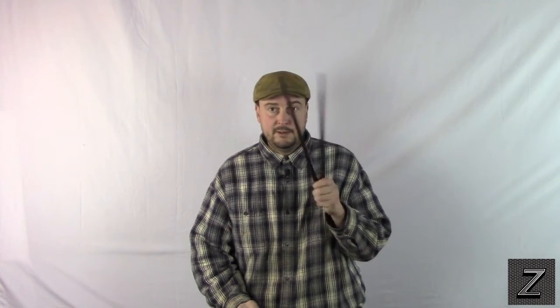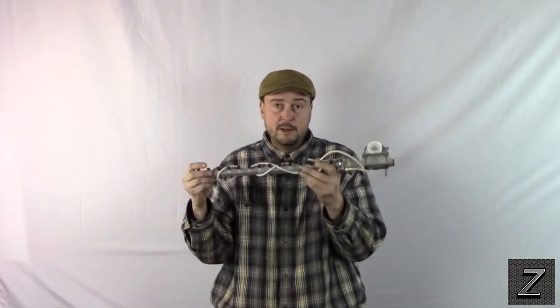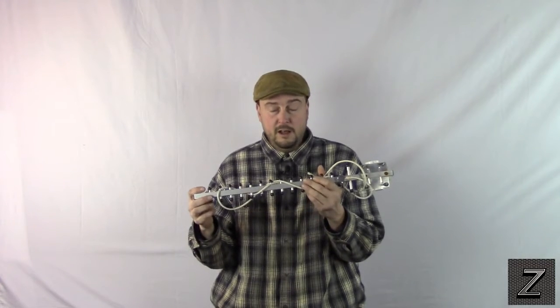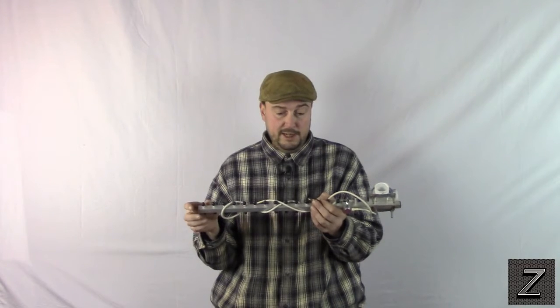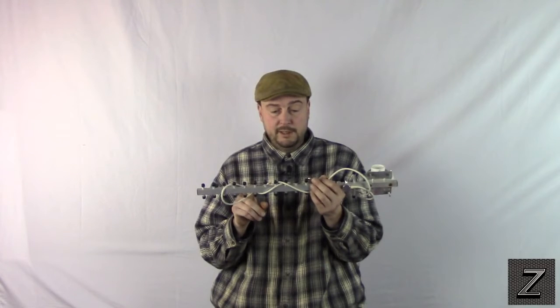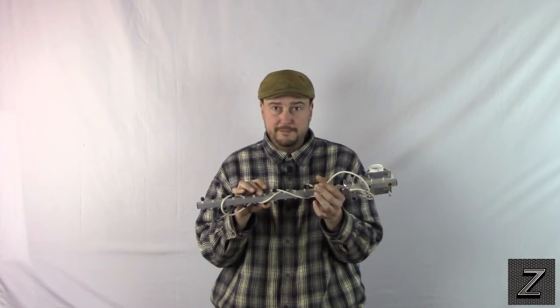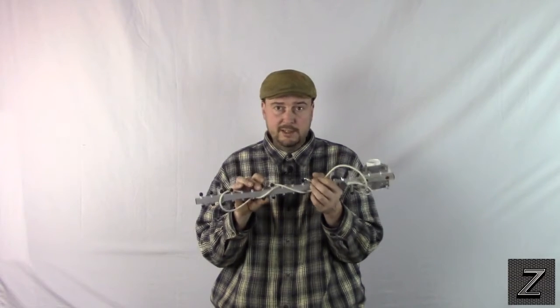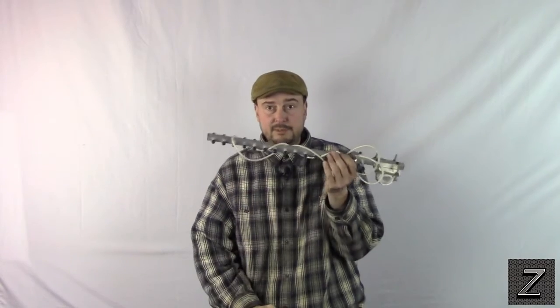So these vertical antennas don't work — don't waste your time trying them. Next I hooked up the straight wire antenna and repeated the same procedure with almost the same results. The unmodified module would actually connect slightly further away. I did run an app that lets you search for Bluetooth, and I was able to detect the modified module about 20 feet further away, but I could not connect to it — only detect it. Same results: nothing.